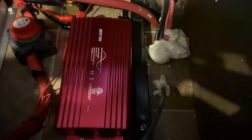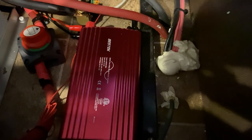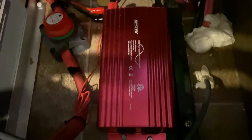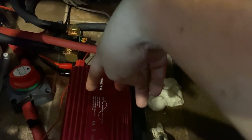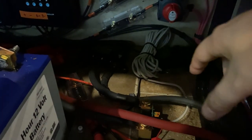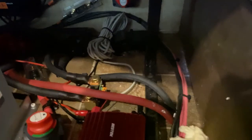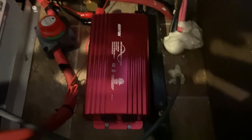Just for context, this is the second inverter — made by BestTech, 500 watts, pure sine wave. Starlink is apparently very fussy about power quality. The wiring is done correctly and I have tons of videos about how I've wired everything. The wiring from here goes there so it can still be measured by the Victron battery monitor system, and then the Starlink cable comes through the hole.